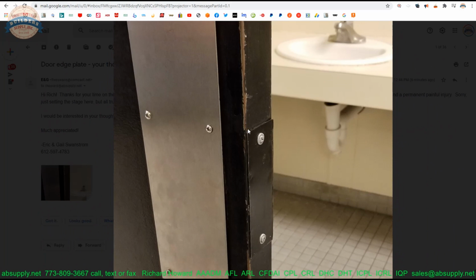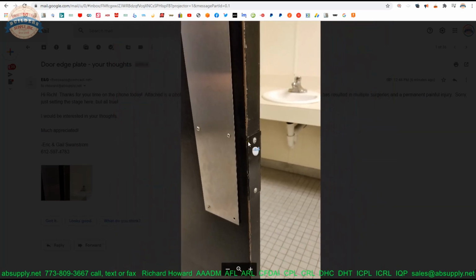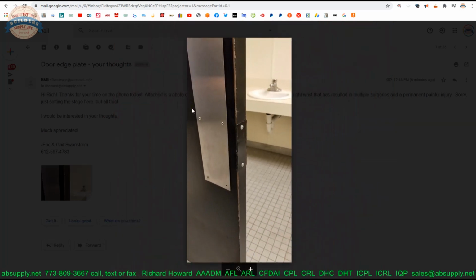Now, that's a hinge filler. That's meant to go into the hinge preparation in a door, to blank that off, and there would be a very valid reason for doing so. And that plate would be flush with the edge of the door. Now, seeing obviously that there was likely a passage or a privacy set, probably a passage set on this door, because it's probably a multi-use bathroom, they would have put the push plate on this side, the same plate on the other side with a pull handle to cover the 2 1/8 inch hole.